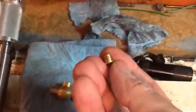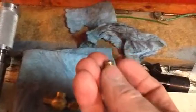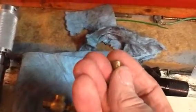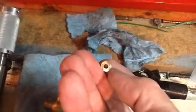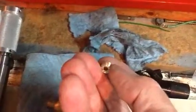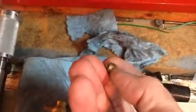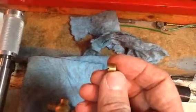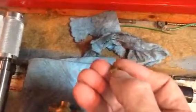Tonight's update, I wanted to show the bonnet bases that I talked about earlier. They're 5/16 inch brass that are threaded 5/16-40. There's a hole drilled and reamed 1/8 inch that the valve stem will go up in the middle of. There's also a slot cut 40 thousandths of an inch wide, and I made them 40 thousandths deep for a screwdriver to be able to screw them into the bottom of the base.